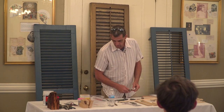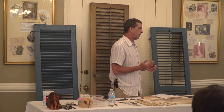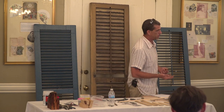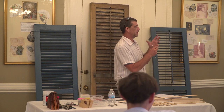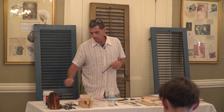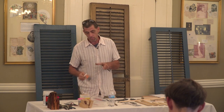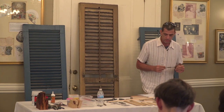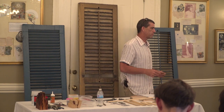A lot of times there's a time factor to gluing a plug in, so I don't like fast glues. Gorilla Glue, urethane glues — I'm more of an epoxy person. Gorilla Glue is really well marketed because it's not a very good product. It creates bubbles in the joint that they advertise as gap-filling capabilities. It's fast, but it's not particularly strong. It's not without its applications, but as a go-to glue it's not really what you want for exterior applications, except where it doesn't require a lot of strength and you need something you can work on in 40 minutes.